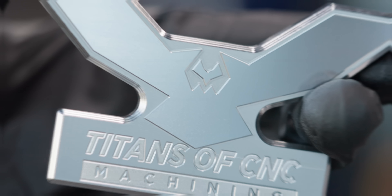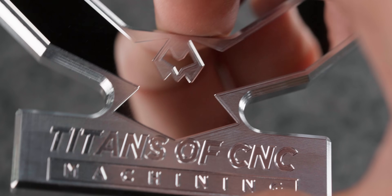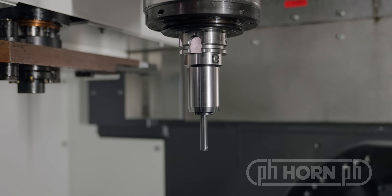Check out that finish. We solved the problem of having those swirl marks and those scratches due to spinning the spindle and the vibrations we were getting. Hopefully you guys learned something from this video and can take something from it and apply it to your scenarios. If you need a finish like this, check out these MCD tools from Horn and try some of the methods you saw here today. Hit that like and subscribe button — we'll see you on the next one.